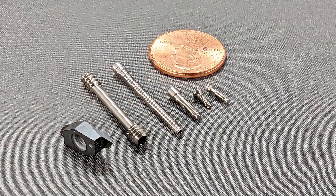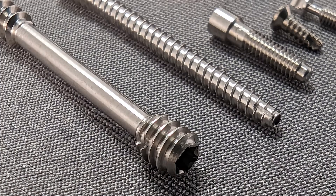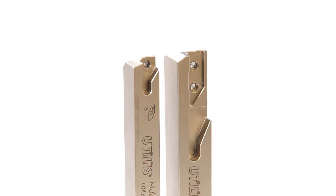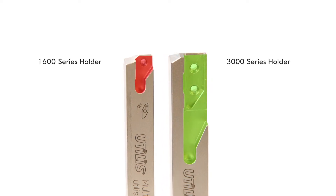The working area is when you're working on workpieces that start out around 10 millimeters and go down to as small as you might want — some of the real micro stuff, things in the 40 to 20 thousandths major diameter range or even smaller. These tools have the capability of machining parts that small, and they have a very similar pocket design to the 3000 series, but on a smaller scale.